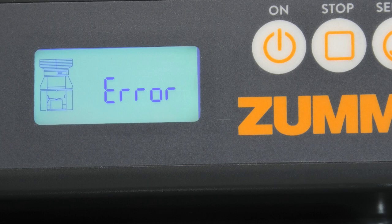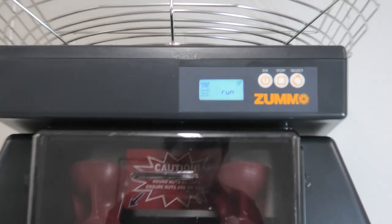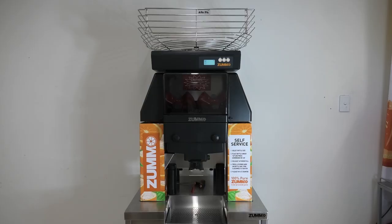External parts are fitted with magnets that tell the machine if it's assembled correctly. The screen will normally display without any flashing messages when everything is installed correctly. Find the flashing part and take it off to see if it is broken, missing a magnet, or simply not placed onto the machine correctly.